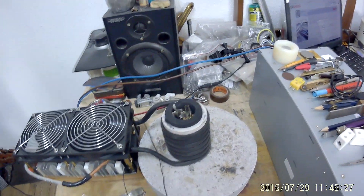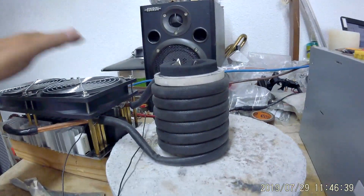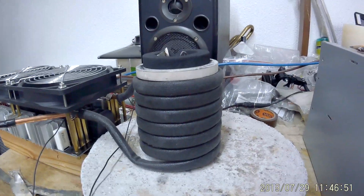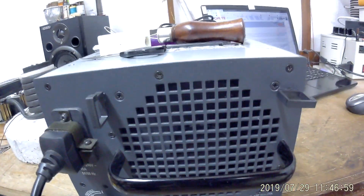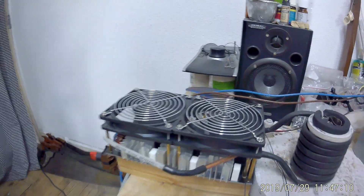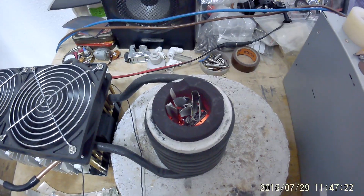We tried it on nine coils, then seven, and we've gone down to six because with nine coils it was heating up more at the bottom than at the top. So this time it heats up more evenly, heating the metal from about the middle rather than at the bottom. These Cisco systems are excellent power units — this one puts out 66 amps DC and it's using about 54 of those amps to drive this induction heater, so it's got a little bit of power to spare. Already glowing red at three minutes and 22 seconds.